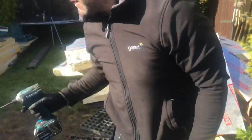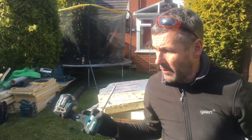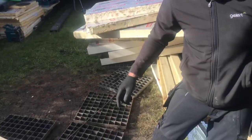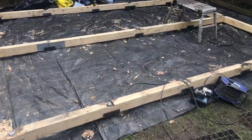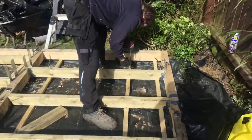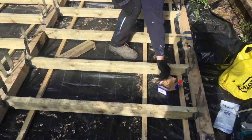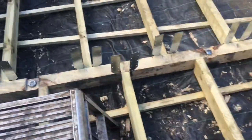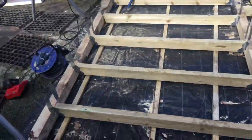What we're going to do now — I'm going to go around with the grinder and cut all the top bolts off, and cut the timbers off. That will be the perimeter of the framing, and then we're going to drop these 4x2 joists in. John's now fixing the slate batten to the bottom of the joists — that will stop the insulation from dropping through. We've dropped all our joists in there, using these joist hangers which we'll nip off and nail over.